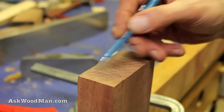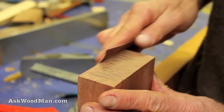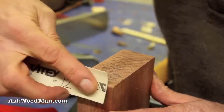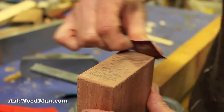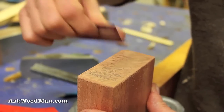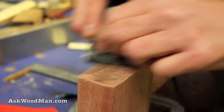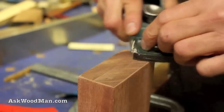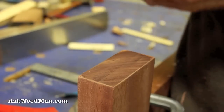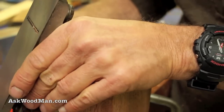Let me put that board of mahogany up here and do that. Again, I'm just going to soften these corners ever so slightly so I don't tear a hunk off. It doesn't take much. This mahogany is substantially softer than that hard maple. Hopefully my plane will be already adjusted pretty close. I have the blade just a little cattywampus, I think.